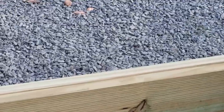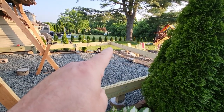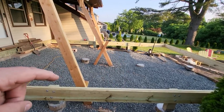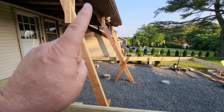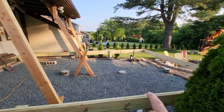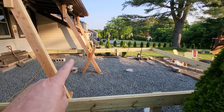So today I'm gonna finish this piece out here, maybe work on these three legs here for this corner, for this support that goes on both sides, and then I got a cross member that's going in here and a cross member that goes in here, because that cross member has to support this roof. So this is going to be a double joist, and this one from here to here is going to be a double joist as well. Not as important in regards to load capacity as it is for this one, but this one's very important.